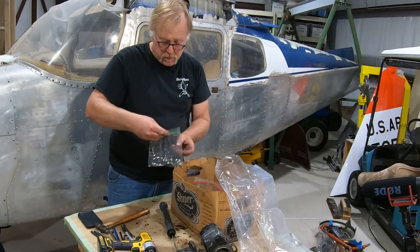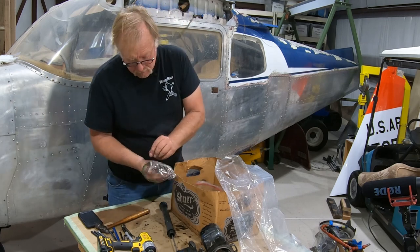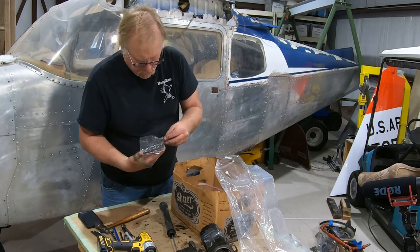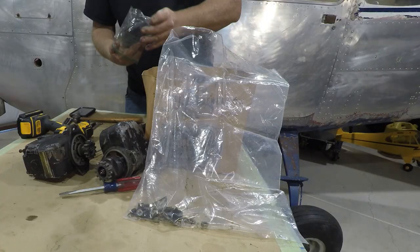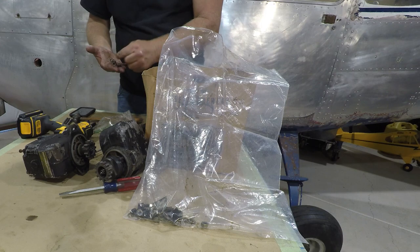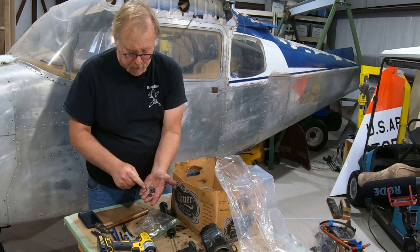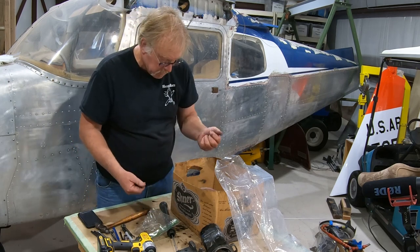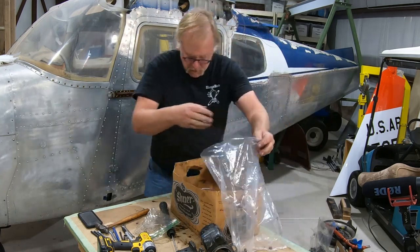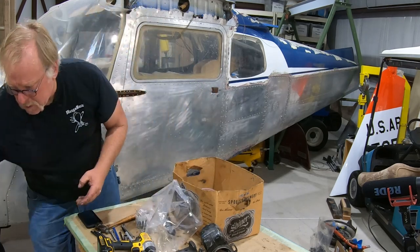Let's see what I have. Magnetos, okay. The only thing in the magnetos we're going to harvest out of here is, there should be two big heavy washers for each magneto. One, that's got a washer stuck to it. These big, thick magneto washers are special. They're actually a Lycoming or Bendix part number. So that goes over to plating. The rest of the stuff goes into the miscellaneous hardware bag. Boom, this bag goes in the trash.